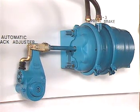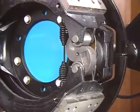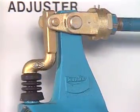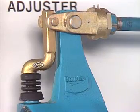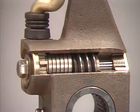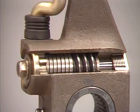When the brakes are applied, the brake actuator's push rod causes the slack adjuster to rotate the brake camshaft, which begins to force the brake shoes into contact with the drum. As the slack adjuster rotates, the yoke assembly pivots on the yoke pin, causing the adjusting link to be pulled upward. The travel of the adjusting link actuates the internal adjusting mechanism. This adjusts the brakes before the shoes contact the drum.